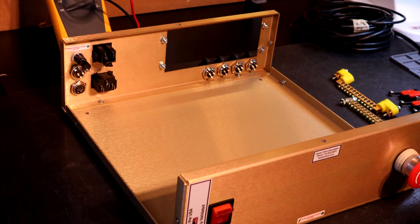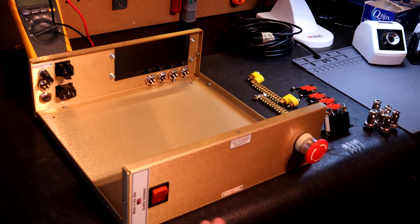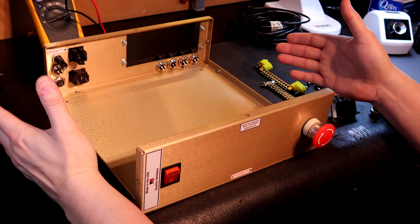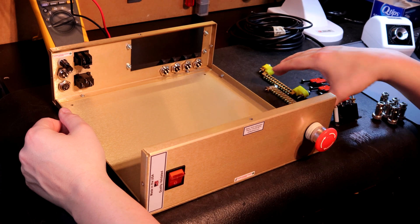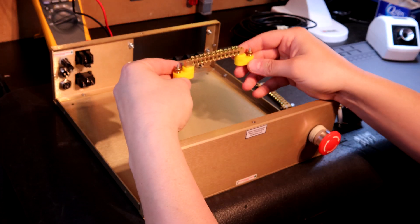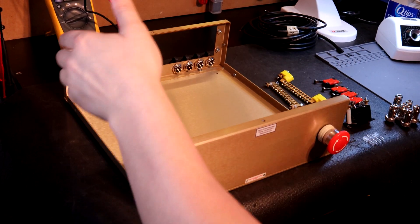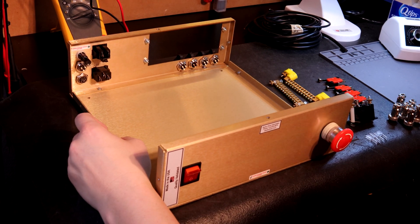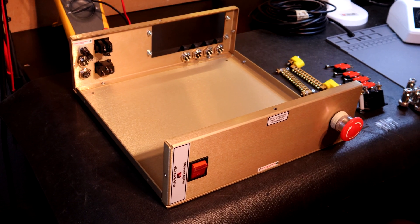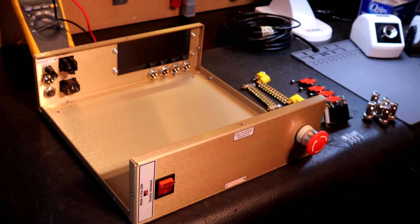I hope the video has been helpful. There's been a lot of chassis on the market and most don't really change much — I kept getting questions on custom built units, and this really mitigates all the confusion about what's available. This one unit will handle everything the G540 can handle. As far as space constraints, you can use spacers and standoffs for overhead mounting. This chassis is really all you require for a G540. If you had two G540s, you'd go a little higher to accommodate the second drive. Overall, for a standard configuration — plasma or more advanced systems — this is all you'd ever require. Please message me direct at storm2313@gmail.com if you have any questions.